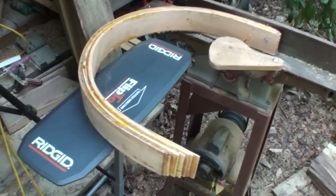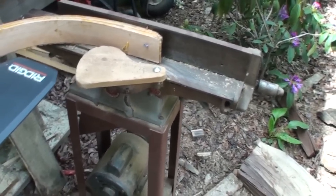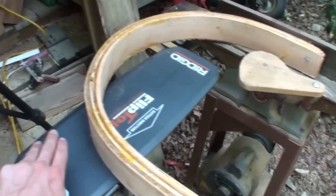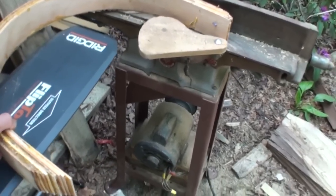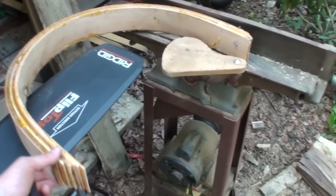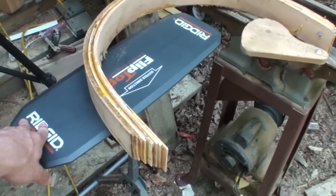For smoothing out one of the sides of the bend, I'm going to use the jointer and then I'll take it to the table saw. Just using this little four-inch jointer — it's a Delta Milwaukee, a little small one. I put this little Ridgid flip-top portable work stand right beside it and that will act as sort of an outfeed. Since I'm doing a curve, I'm not going straight — I'll kind of come out to the side. So to help me keep from tipping, I'll use this off to the side. This is the first time I've ever used it on anything — it's mainly meant for a table saw or planer.